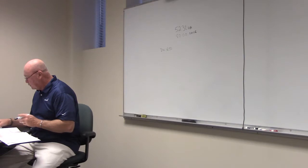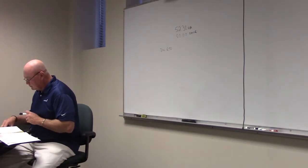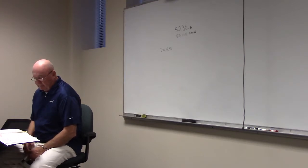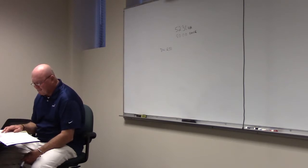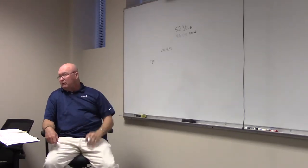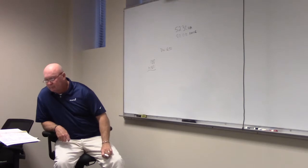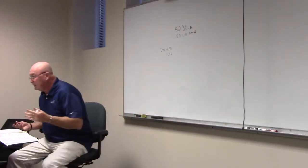Now it says a 3/4 horsepower motor. Now we got to find that one, so we're going to have to go to 430. Y'all help me out. 430 what? Should be 248, but that's single phase. 430.248, which in 2014 is on page 350. And it's a 3/4 horsepower, and it's 120 volts, right? Can somebody tell me how much is that? 13.8 amps, right? So if we want to get it to volt amps, what do we have to do? Multiply by 120. And that comes up to what? 1656. Y'all see where we got that? See how we got that?